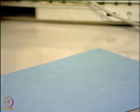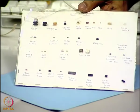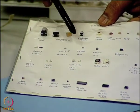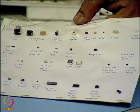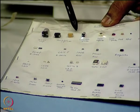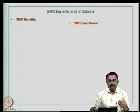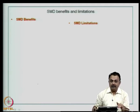This chapter will highlight how you can handle your design right through fabrication and assembly. What we have tried to show here is a mix of various types of surface mount devices — transistors, resistor packs, preset resistors, regulators, BGAs, diodes, LEDs in surface mount format, various capacitors including tantalum, fuses, switches, and trim capacitors. So there are a wide variety of components available in surface mount format, and if you are doing re-engineering work from through-hole into surface mount assembly, you need to be aware of the packages available in the corresponding format.